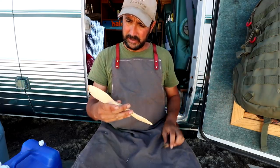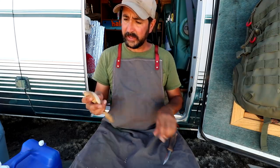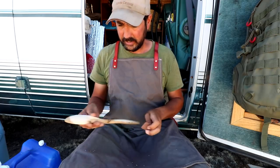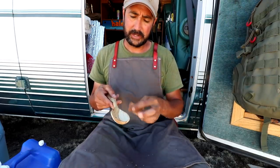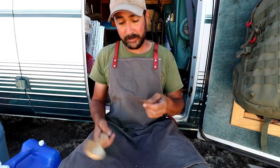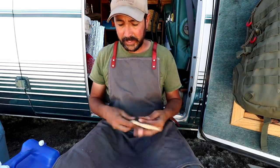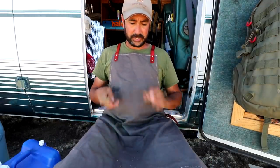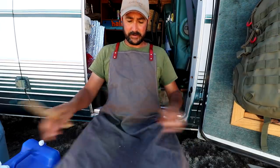What I might do now is go in with some pretty rough sandpaper to get rid of a lot of these rough tear-outs. This is 60 grit — you have to be careful because it will smooth out rough spots but it's going to leave some pretty deep scratch marks that will need to be sanded out with a finer sandpaper. Ideally I should go with 80 or 100 grit but I don't have any on hand. I'm using an apron because I'm in the doorway of my van — I don't want shavings and sawdust tracked in. An apron is great because you can catch everything in it, then stand up, fold it up, move somewhere else, and dump it out.